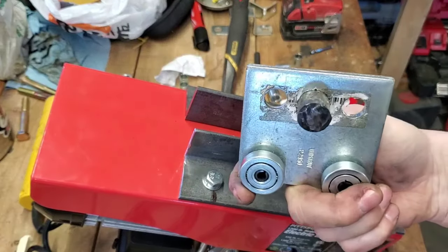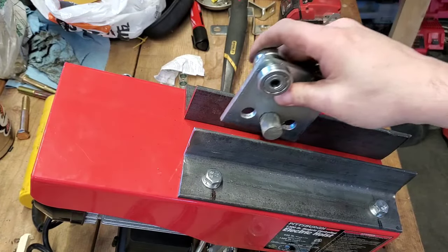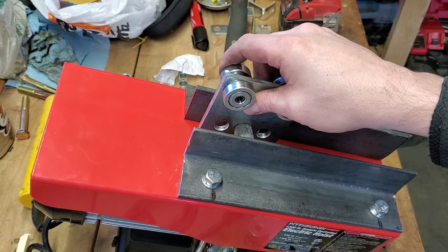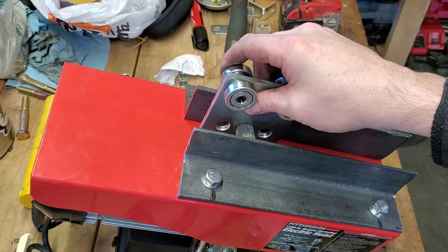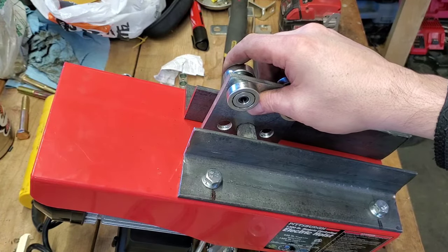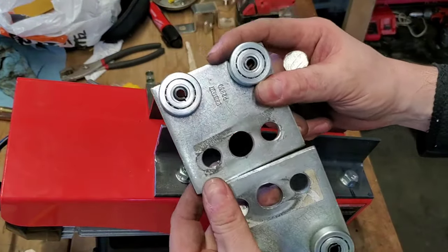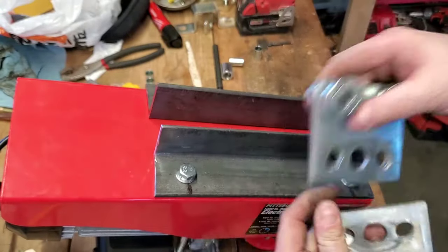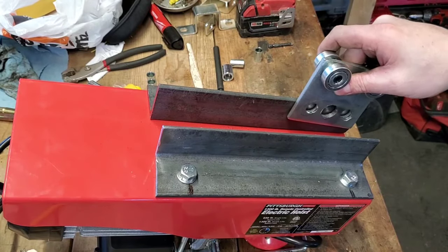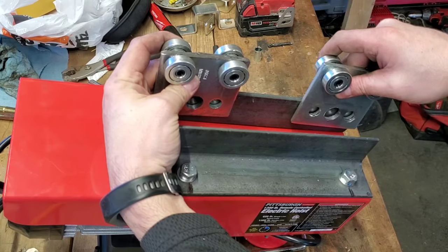I went ahead and drilled out my center hole bigger on my trolley and cut down a piece of that bar stock — that looks like it's going to work rather well. I haven't welded it yet, but I set that there and used my two bolts through there; I think that'll work just fine to keep it from sliding back and forth. I'm going to make up the other one and then catch you guys back up. I've got both spacers made and both center holes drilled out, now it's time to figure out where I want my holes to be on the trolley, so I'm going to go ahead and mark those out.